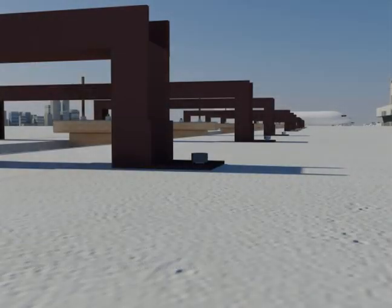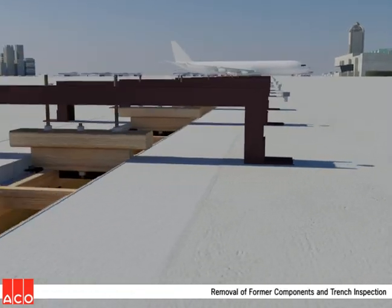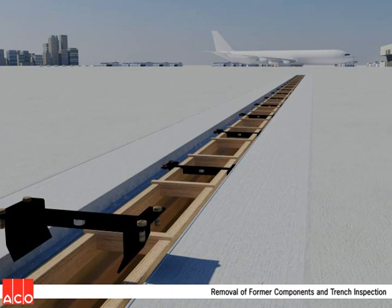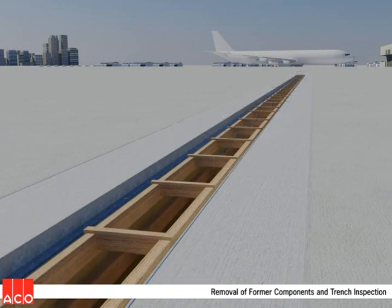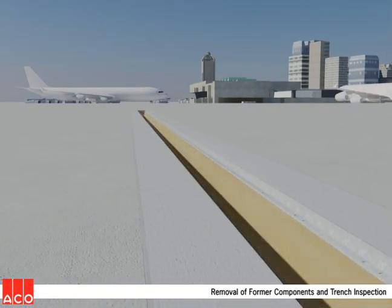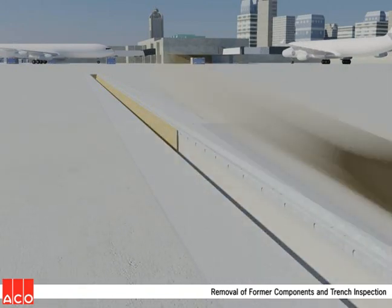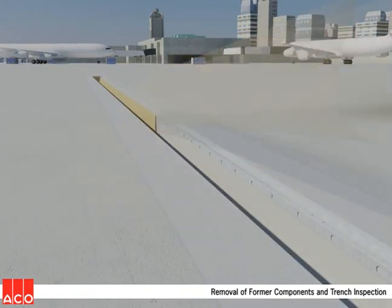The deforming process involves only a few simple steps: removal of the hanging devices, removal of the crossbars and wood bracing, and finally, removal of the fiberglass forms themselves. All of these components are reusable, so they should be set aside and protected.